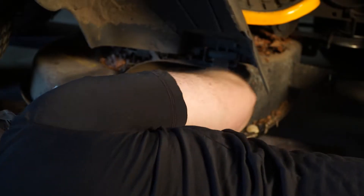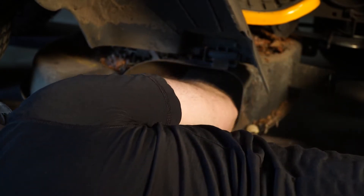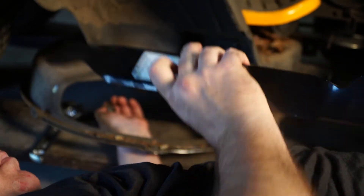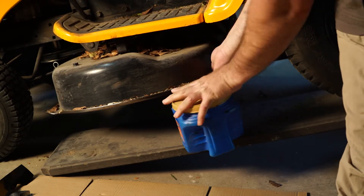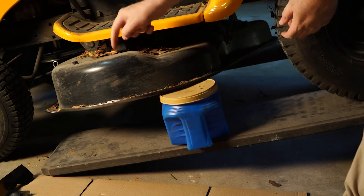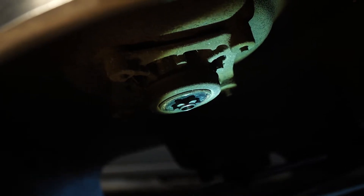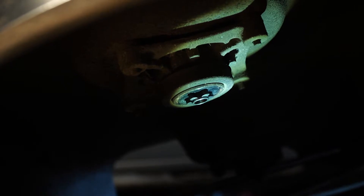As I'm loosening the bolt by spinning this blade axle — you want to install the blade with the sticker up. This side's a little more tricky, so what you want to do is wedge this side up so you can get under there. I'm using a coffee can to wedge up this baffle so I can get to the blade easier. That is the star-shaped spindle that you're going to attach the blade to, and I've got it illuminated here so you can see it.